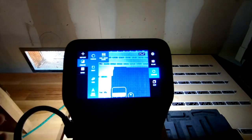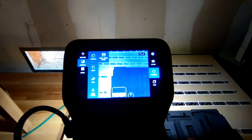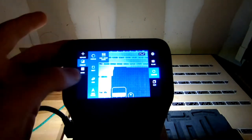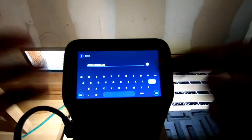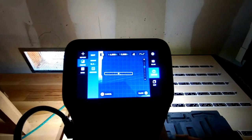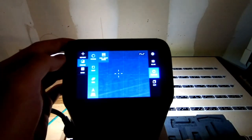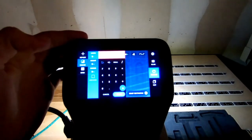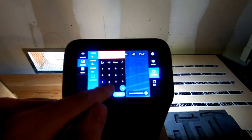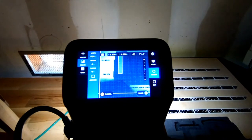This is a good chance to highlight that if you don't know Origin, there's actually a lot of functionality right on tool where you don't need a computer to design files — circles, rectangles, slots, pen tool, text, and we even have an extension that does box joints. All these things can be done right on tool. You just click it, type whatever you want for the text tool, and that file gets generated instantly. For foam this doesn't make sense but for a lot of other things it does. In this case we're going to go with a rectangle and type in exactly the numbers we want — the width was 1.125 and the height was six.